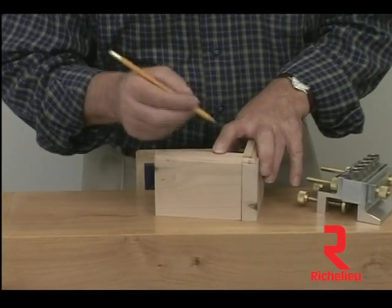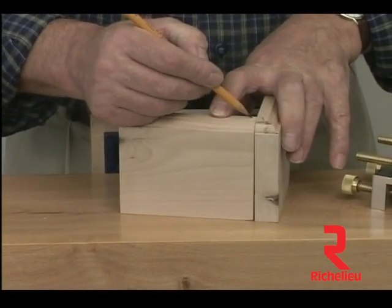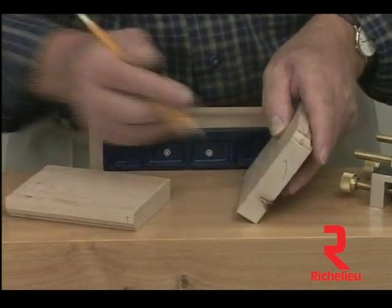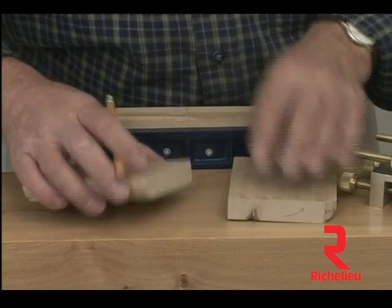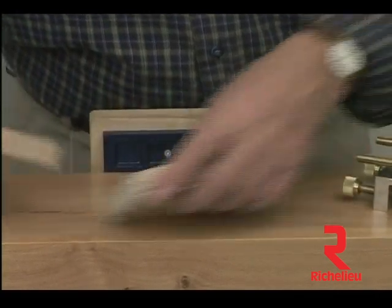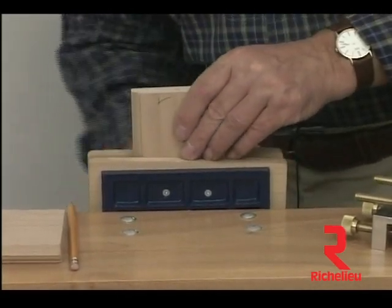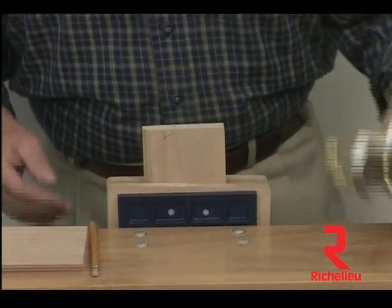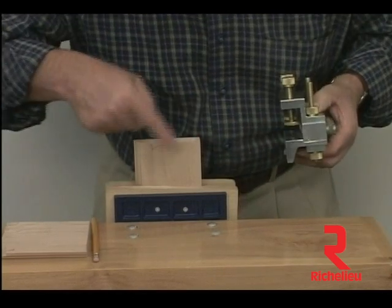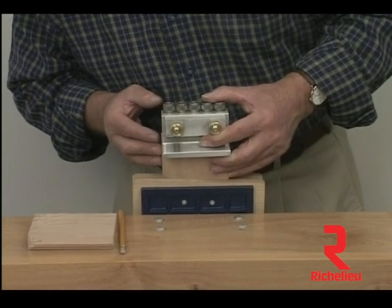The exact same procedure is required. You place the pieces together, place the check marks on the important reference faces, and X on the surface to be drilled. Take the first workpiece, install it in the vise, and again, in the normal configuration with Dowelmax, place the check mark to check mark and check mark to check mark in the usual manner.